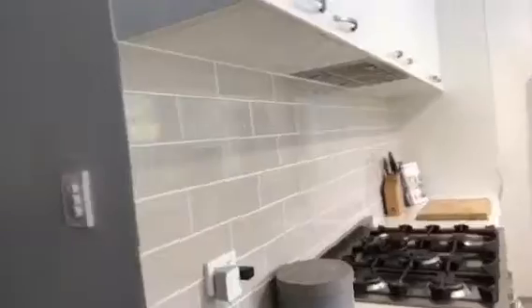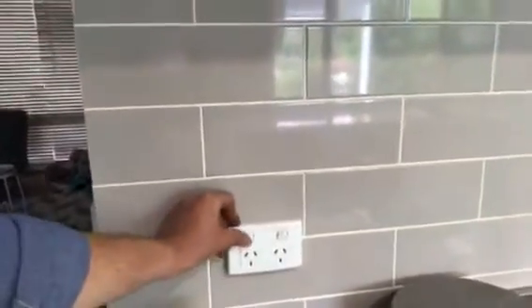So what we've done is identify the fault back to this kitchen — in this case, the representative fault back to this kitchen. What we'll do is go around and physically unplug every appliance in here. We want to make sure we actually do unplug it, because you can't just switch it off at the wall — that won't clear the issue.